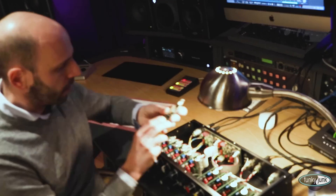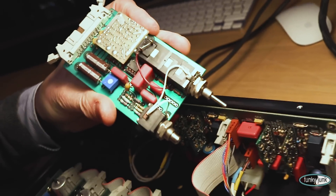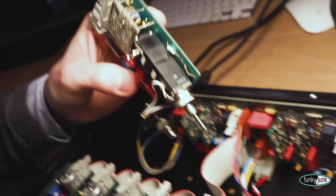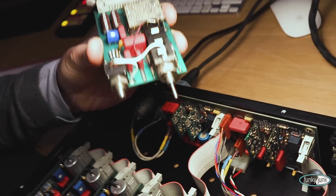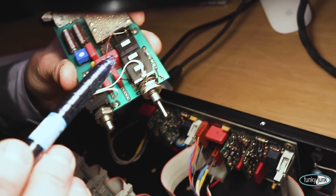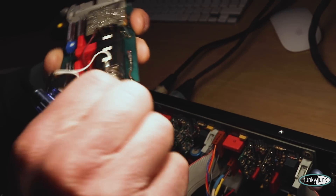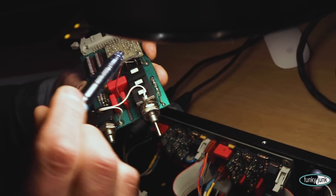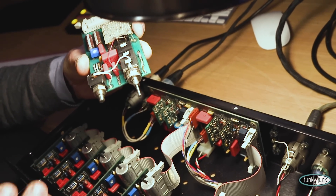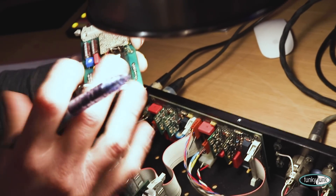It's easy to see on this card I pulled out from another unit. This is a revision one, so it's slightly different in terms of component layout and op-amp revision. If you look closely, what decides the frequency is this capacitor here and this resistor here. This also does the Q — the middle part for the Q. So changing this capacitor changes the frequency range of the actual card itself, which is really clever because by just replacing one or two components, you can really tune the card up.